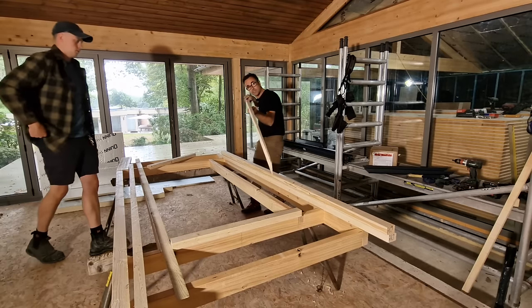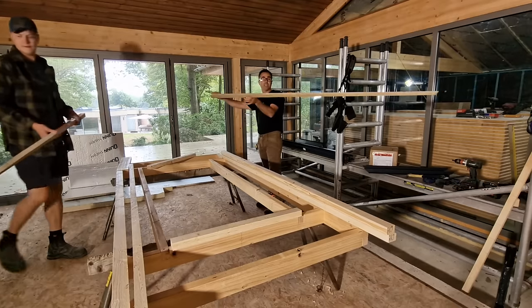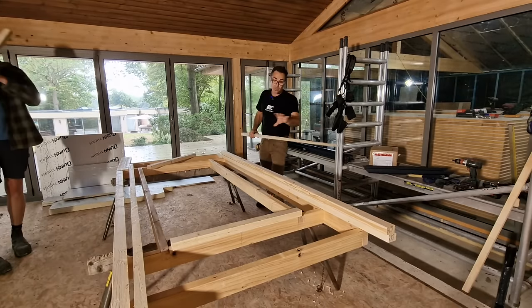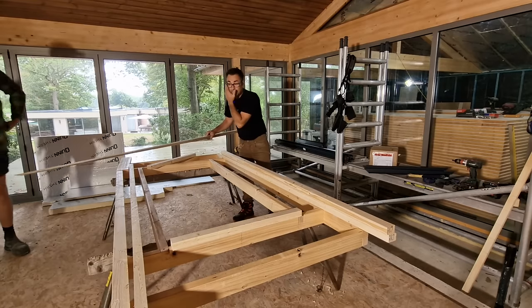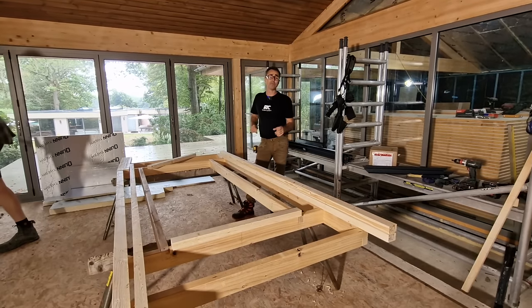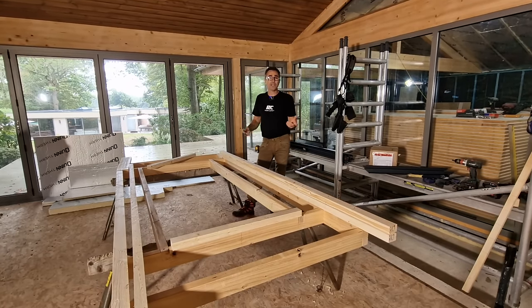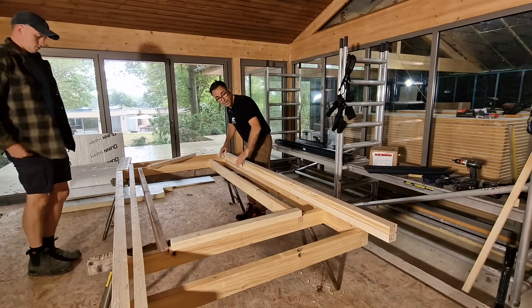The furring is a really long, tapered piece — basically like a wedge. It takes all the moisture down to the other end of the roof. The ceiling's obviously level, and this forms the falls. What we don't want to do is make our upstand on the taper, because it takes too long and it's not much point. So what we'll be doing is fixing our upstand directly to the level frame.